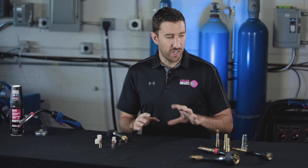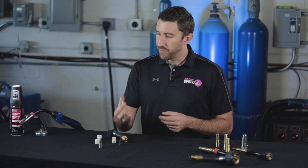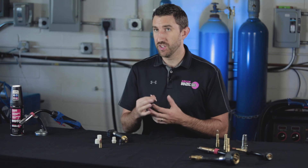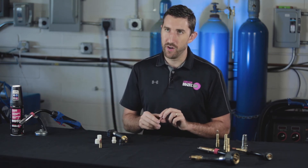In summary, you have two main choices: brass and copper alloy. With brass, you get a more durable, more cost-effective option, but not quite as much performance on your front end — it will make your contact tips run hotter and they probably will not have as much life as a result. With copper alloy, you get better heat conductivity to your contact tip so your tip will run at a lower temperature and last longer. Copper alloy also has better wire abrasion characteristics, though it's not quite as crash-resistant or reamer-friendly. You'll also get reduced voltage drops with your welding gun while it's in operation.